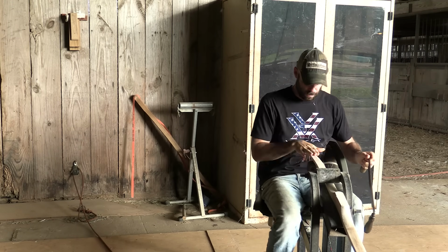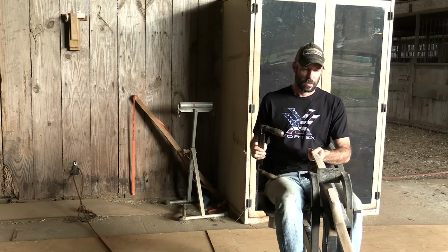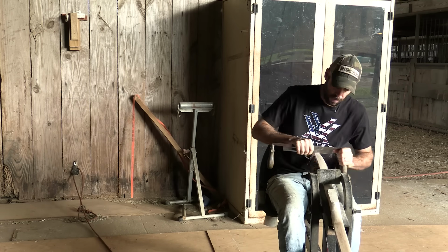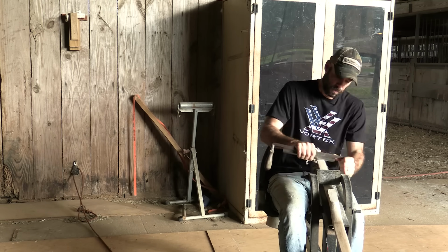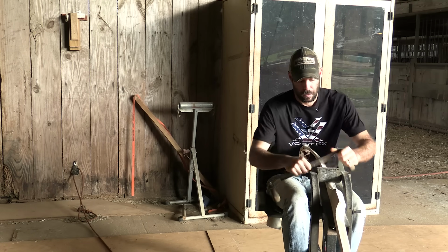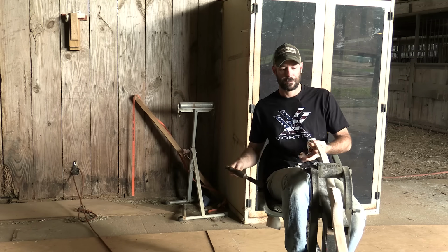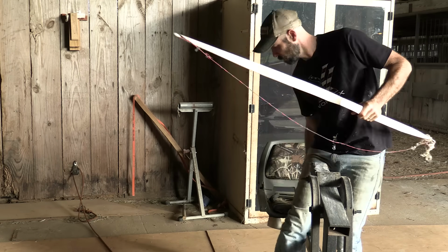All right, so this is that stiff section of this limb. So I'm just going to turn my draw knife up about a 90 to the limb. Take about 10 good scrapes off of here. Round those edges back out just a little bit. We'll put it back up here, see what that did.